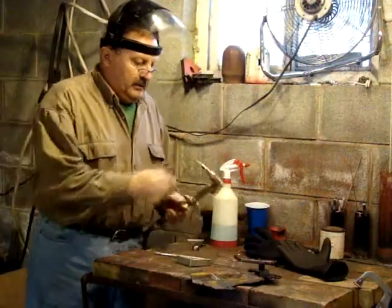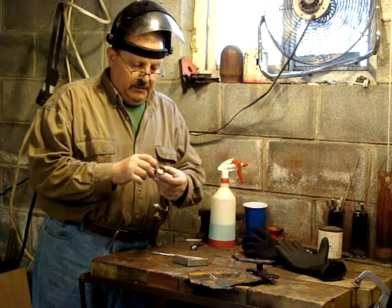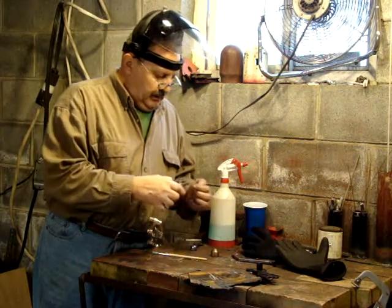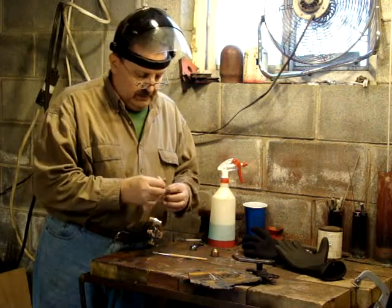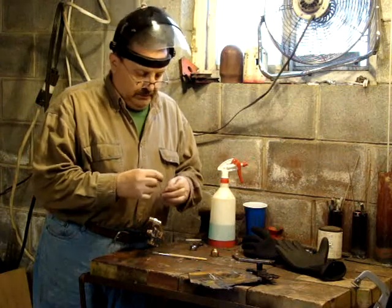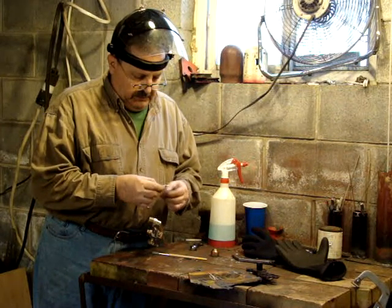The tip on this needs cleaning — that's the problem. Maybe a bad tip, but clean it up and see. When you clean the tip, you're better off taking it out from the end, because any dirt you push in will stay in it. As soon as you turn it on it's going to plug back up. It may come out or it may plug up — if you're in a hurry you could do it the other way, and it probably would work fine.